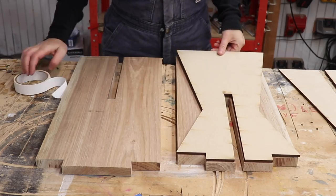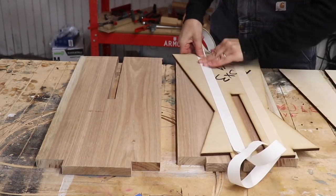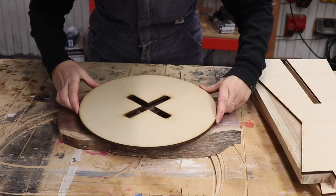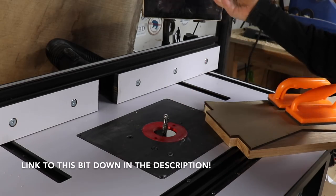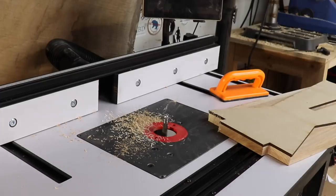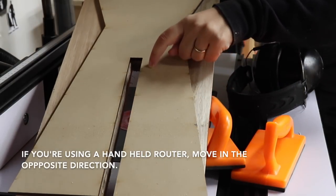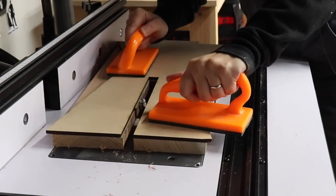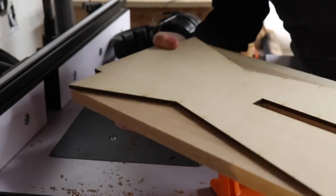Time to make all these cuts perfect using the templates and double-sided tape. I'm just going to line these up and put it on. Now all you need to do is clean up all those cuts with a flush trim bit. I'm using a router table, but you can just use a handheld router as well. For the slot piece I have to be super careful about which part of the slot I'm riding on — I'll start from over here, cut along this way, and then loop around so that I'm always going against the spinning direction of the bit.